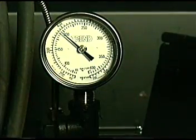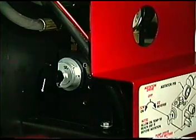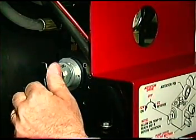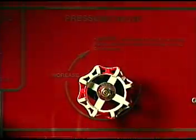Start the agitator. Reading the Fahrenheit scale on the oil temp thermometer, when the oil temperature reaches 400 degrees at about 30 minutes, start the agitator by turning the lever on the left side of the hydraulic manifold counterclockwise. At this time, the sealing hose valve should be closed and the pressure valve set in the full open counterclockwise position.